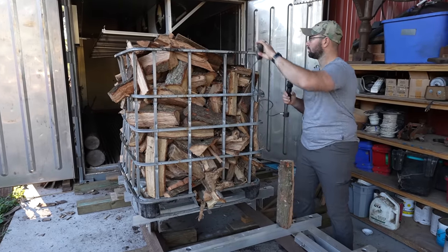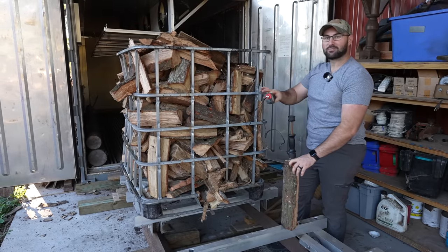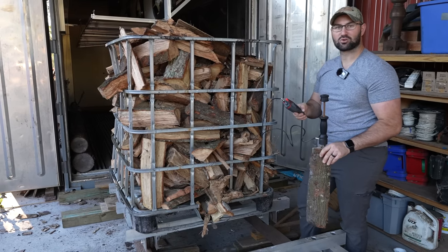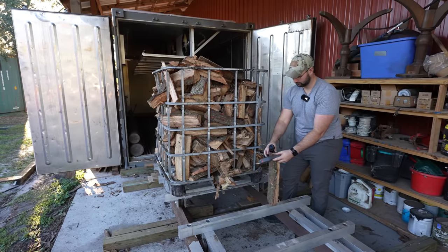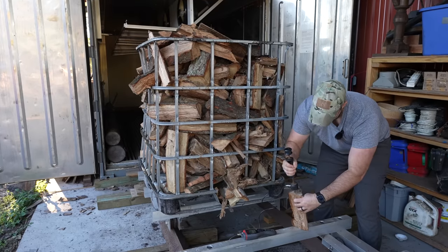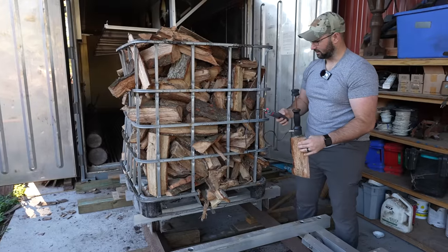We've got our setting on red oak, and we're going to drive our pins in. As you saw, after five days in the kiln we were at 12.2%. Right now this fresh firewood is at 40.2%. So in five days this kiln is able to dry this stuff down to perfectly dry where we can sell it as kiln dried firewood. Just to show you, here's a little tiny piece — let's test this one. We're looking at 45% on this one. So this stuff is very, very fresh — it was just split yesterday.